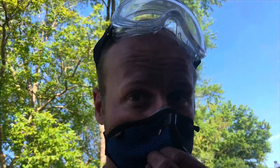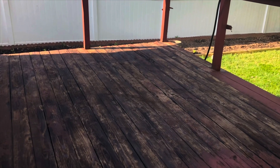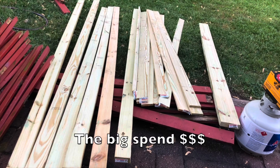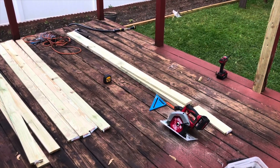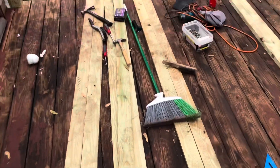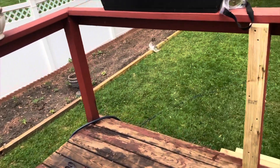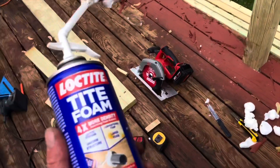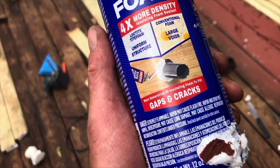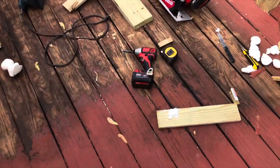Make sure to wear a mask when doing this. I'm still working on removing the paint - it's a pain. But I started putting the reinforcements on with 1x4 pressure-treated beams on any weak parts or any wood that's been beaten up. I also filled in all the gaps in the wood with foam for gaps and cracks, just to make sure there's no chance for moisture getting in there. There was one hole in there and stuff like that. Going to pop this out and continue, then finish with the paint.